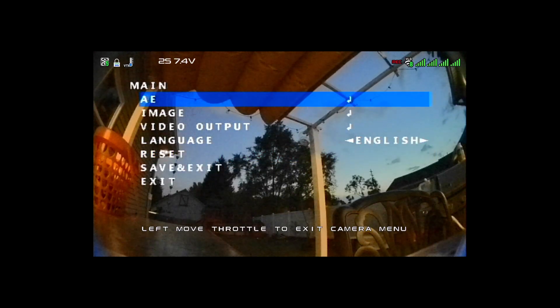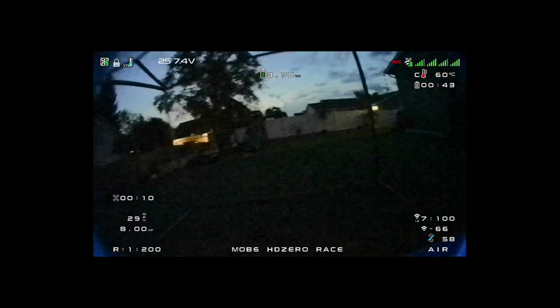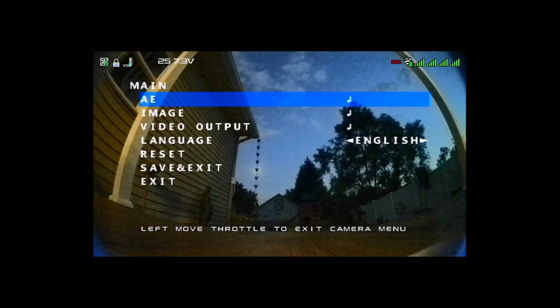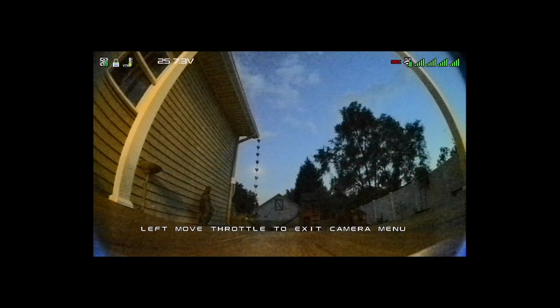Let's set the gain down — five is the default. If we want to see better at night, we'll bump the gain up. Let's do a quick spin and compare how it looks with the gain all the way up. You can see okay, but it's nothing spectacular — there's not too much noise, it's just kind of dark. Now let's go into the Lux camera menu, go to the top setting, and crank up the gain, which is basically setting the upper limit for ISO on this camera.